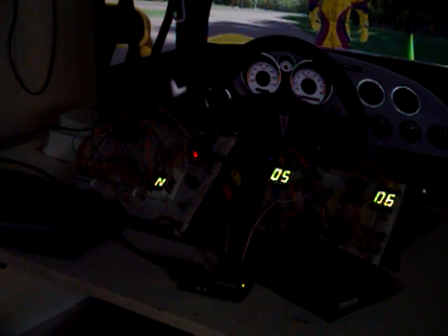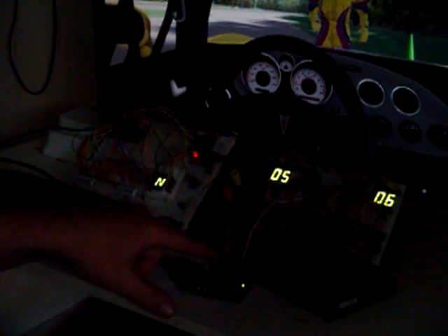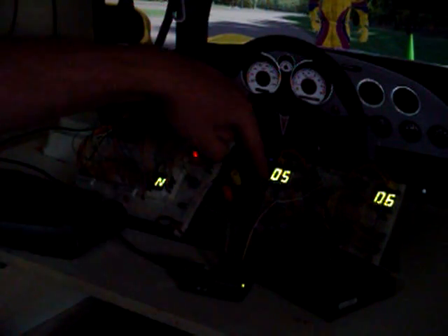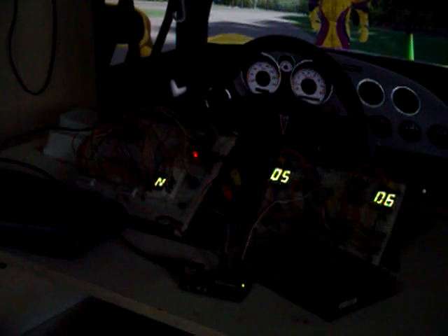Here's what's really cool about this project: I've got a total of 71 LEDs being controlled by five pins on the Arduino. This one over here is actually just the ground, so that one doesn't count. These two go to the 5451 chip and they're driving 30 LEDs right now. And then these three — there's a line of chips here — that's four 8-bit shift registers running in series. And then we've got the seven-segment displays, so that's another seven LEDs for each. Anyways, it works out to 71 LEDs on five pins on the Arduino.